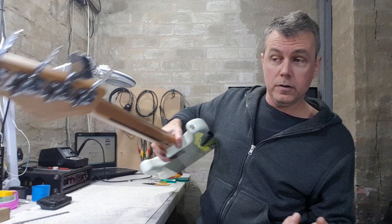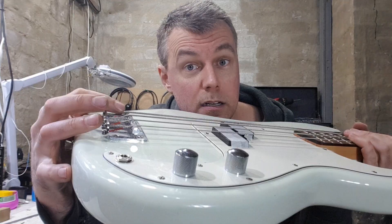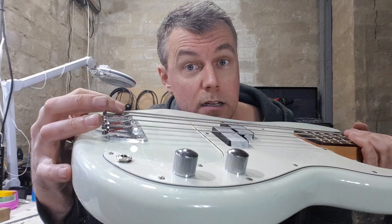It's time to put the neck back in. The neck's back on — it's absolutely rock solid in there, which is good news. I've got the strings on, they're up to pitch. I didn't adjust the truss rod or anything, so the relief is exactly where it was. I've set the string heights to just about where they're going to be once the bass is all set up, and the saddles are now at an appropriate height — the grub screws are just underneath the tops of those saddles. So that's a win. Anyway, this guy's going to go onto my neck jig and get a good old fret dress. I hope you enjoyed the video — please hit like, share, subscribe, comment, and bell, and I'll see you in the next one.